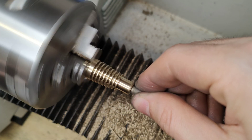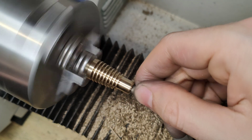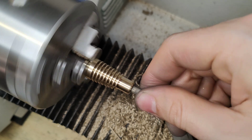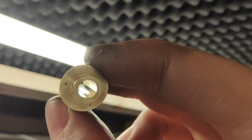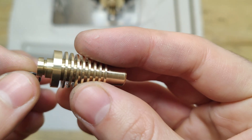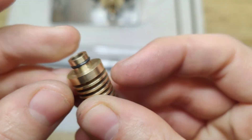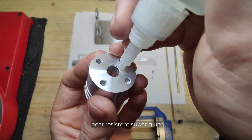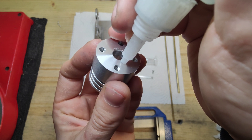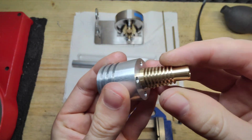Here I'm using some really fine sandpaper to grind the inner surface of this cylinder, because the piston rod has to run through it really smoothly. I'm repeating this process until the piston rod doesn't have any friction in there. Then I'm attaching the silicone ring with a bit of super glue, which is also heat resistant, and these two parts hold really tight together.